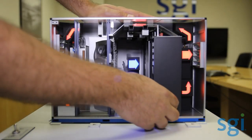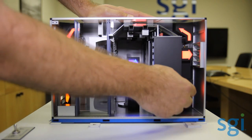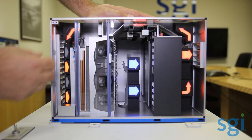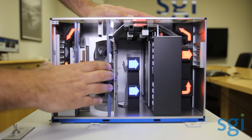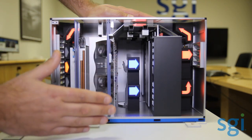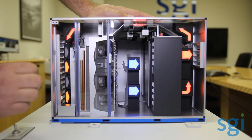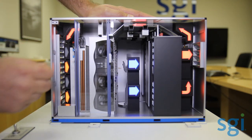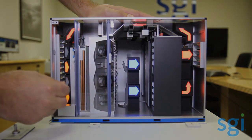In high humidity scenarios, we close the louvers on the front and outside, bring the server zone heated air back around, which drops the overall relative humidity by about seven percent. Contrary to a lot of belief, this unit and cooling system can go into very cold environments, very hot environments, very low humidity environments, and even very high humidity environments. We evaluate customer deployment locations to ensure the unit will perform as required depending on their ambient conditions, providing the correct ASHRAE-defined inlet temperature to servers and hardware devices.